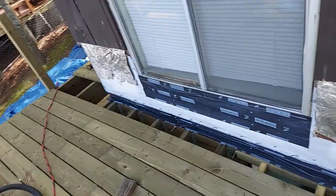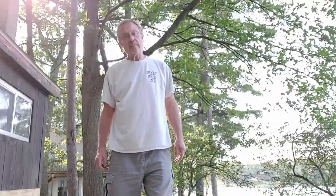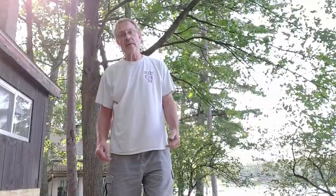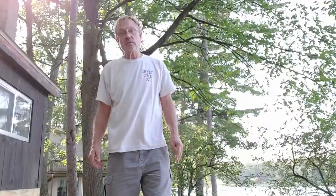So I'm going to get my decking boards back on, and I'm going to cut some plywood and get this covered up. I've got this all wrapped up, and of course that's going to wrap us up for this week. But I just want to say a couple of really important things. One is, when you're putting on the house wrap, make sure that it's on in the correct direction, because with the outside of it out, it blocks water from going in, but it allows moisture to come out. If you put it on backwards, it will block the moisture in, and it will allow the water to go in. So you have to make sure your house wrap is on with the correct side facing out.